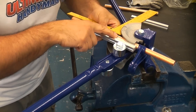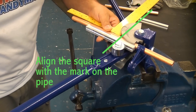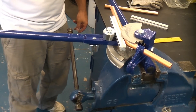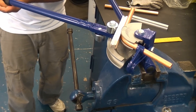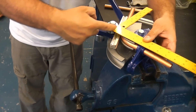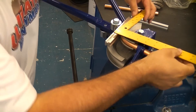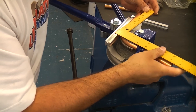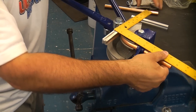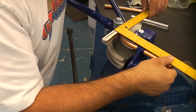I've drawn a line on each piece of tubing in the exact centre. Once that's in the correct position I'm going to pull on the handle and that will start to bend the tube. We're now going to check on the top using a square to see exactly where 90 degrees is — you can see that it needs to move considerably more to get to 90 degrees. Whenever you're bending anything like this you just need to go past 90 degrees because it will spring back slightly.